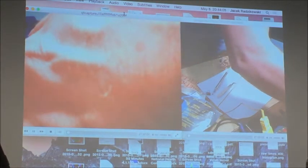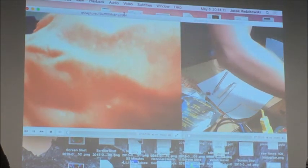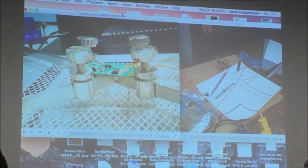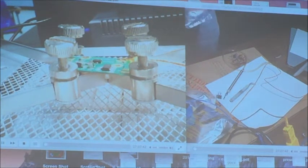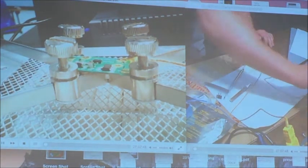Would it be a bad thing if the solder melted while sitting on that heater plate? Well, it wouldn't be a bad thing. Some people actually use hot plates to solder. You just have less control over it. When you use hot air, you can control pretty well how long it is at the melting point. If you solder on a hot plate, it's a little bit difficult to control. It would be one of the techniques, but then you wouldn't use hot air. Okay, let me switch this on.